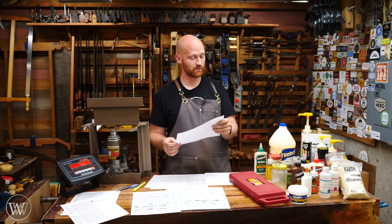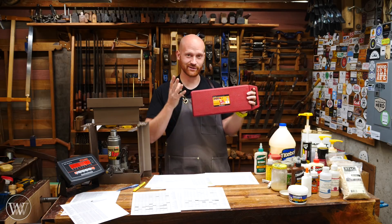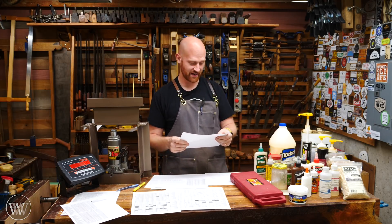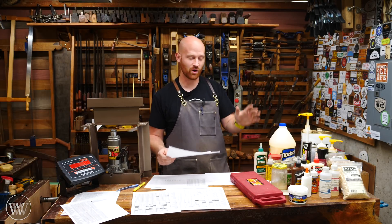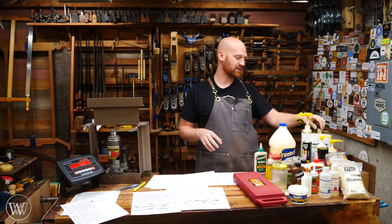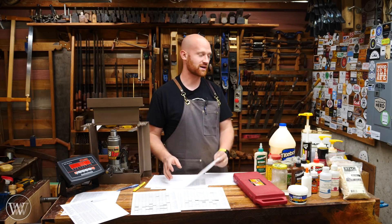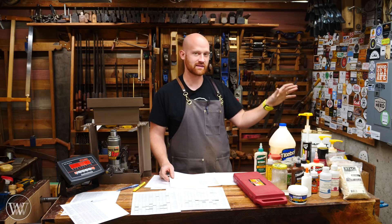For an outside glue, I don't think I would use Titebond 3 as I would have in the past. The glues in positions 1, 3, and 4 are all 2P10. The gel and thick glue actually did really nicely in the exterior tests — the 2P10 gel had 337 PSI, the 2P10 thick with activator had 312, and without activator had 298. All in the same ballpark as significant exterior glues. Right behind those are the West System epoxies, and particularly the West System Fast did really well for exterior work.